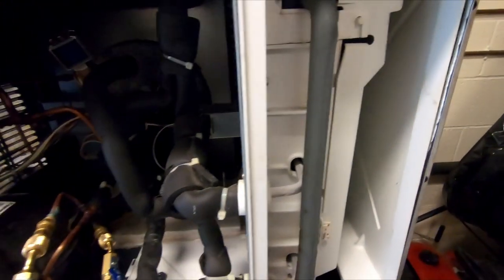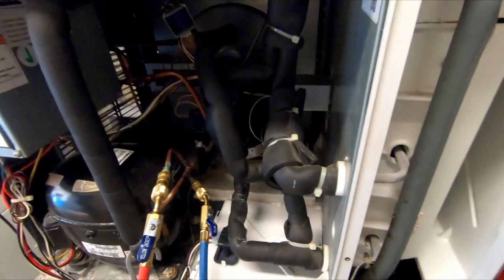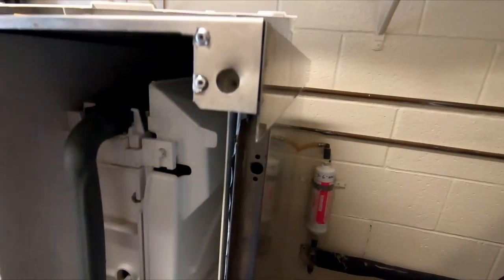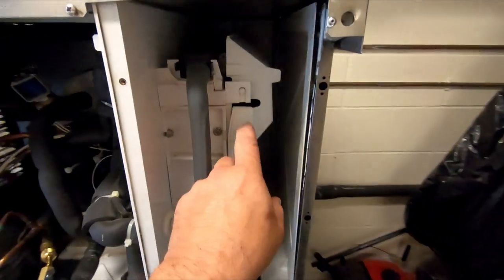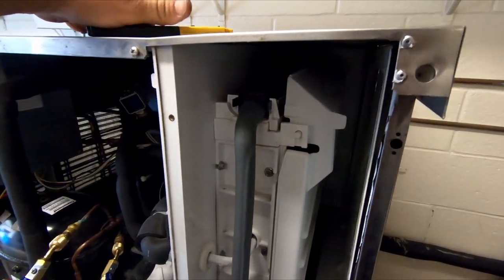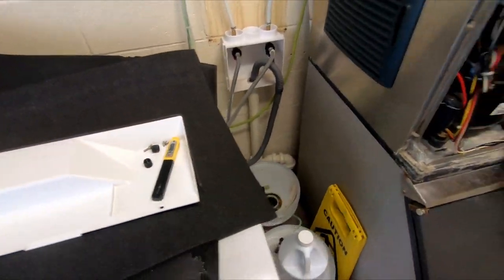It doesn't look like it screwed with it too bad. You can hear some clicking, so it should be getting ready to go into a harvest. Yeah, right about now. I don't like it going too far and all that clicking. Usually that's likely to tear apart your plates in here and then you start losing the center dividers and stuff, which will cause harvest issues and things like that.